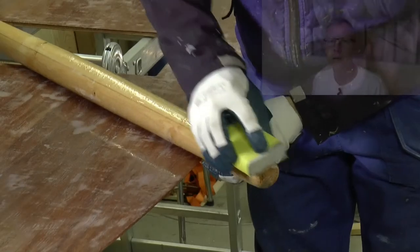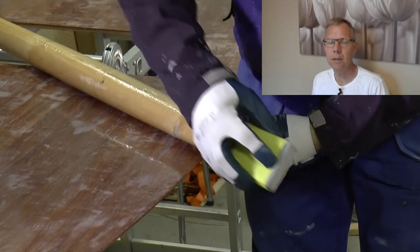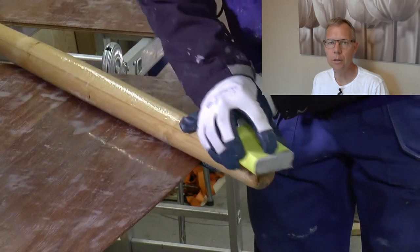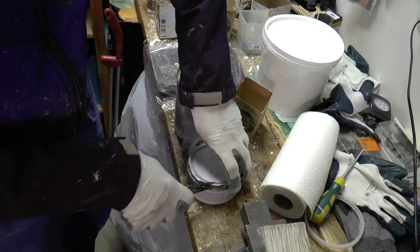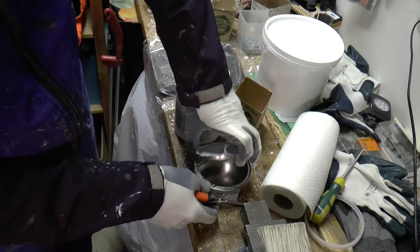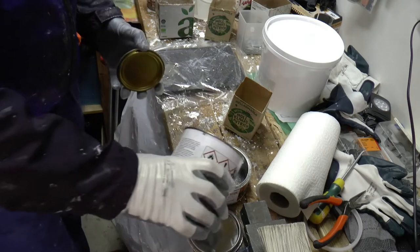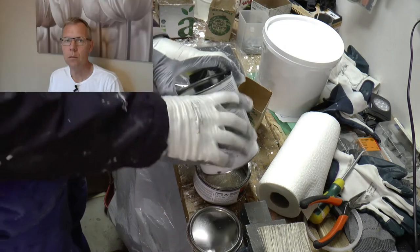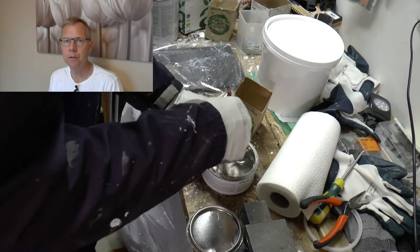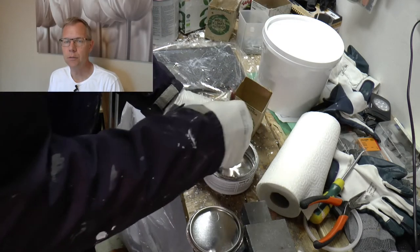After putting on a second coat of epoxy on the bowsprit, I'm now up to the same state with all pieces and ready for varnish. The bowsprit cures overnight and I sand it lightly before the varnish can start. First I use some leftovers from last year for the first coat.